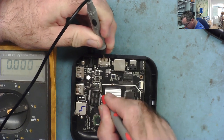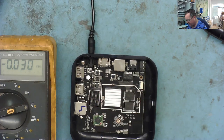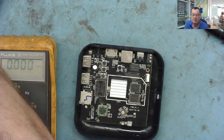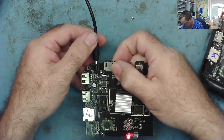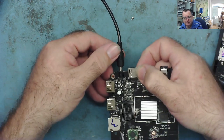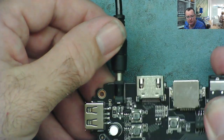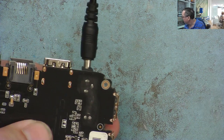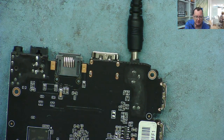Nothing, nothing, nothing - we have a problem with the power coming in on this one. Let's get these circuit boards out and see what we've got. This is the one that seems to be working - I'll zoom in a bit. You can see the actual socket itself is moving on the board. I'll switch it off while waggling this around - I don't see any obvious problem with the solder joints. Let's get the microscope and have a quick look.